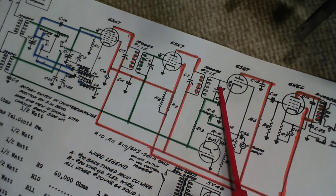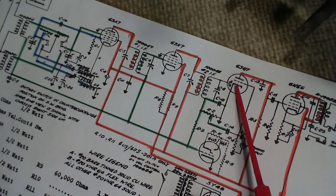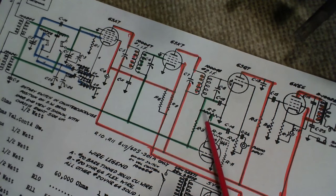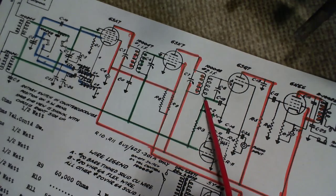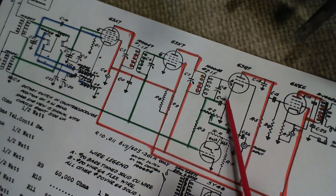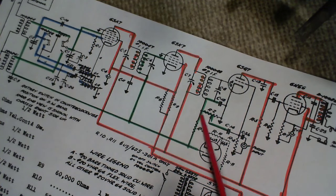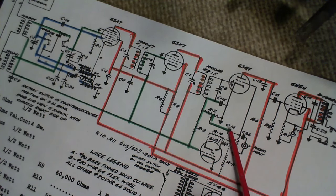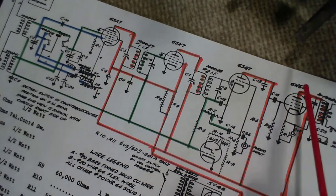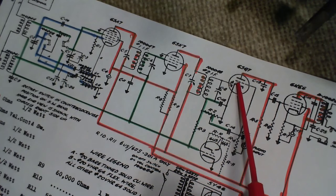So out comes the 462.5 kilohertz signal, and it's simply rectified through here. And the act of rectification enables the audio signal to be recovered, or detected, which is the word we all like to use. And ignore the green stuff. It just comes down here, goes through the volume control, a portion of which is then fed through this capacitor back up into the other side of this dual function tube here. So now the audio signal has made it to this grid, so it's amplified in this tube,